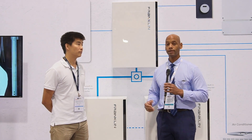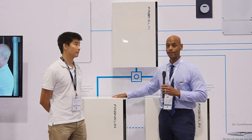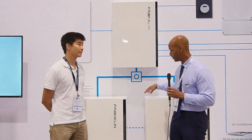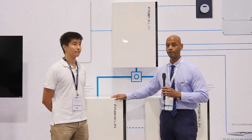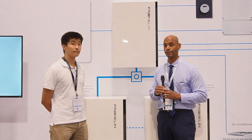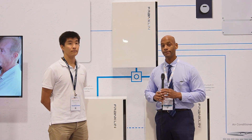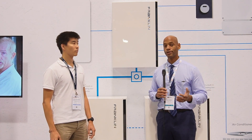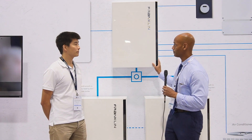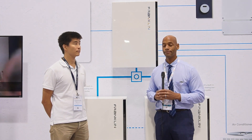This has been a brief introduction of the Franklin whole-home battery backup system. You can technically do a whole-home backup with just a single Franklin battery, though for most clients I'd recommend two A-Power batteries connected in parallel, or you can expand to three or four from there. At least two if you want comfortable whole-home backup and the ability to run central air conditioning during the evening hours. For installers currently offering Solar Plus Storage, or interested in adding storage due to growing homeowner inquiries, this is a great way to get started while minimizing the risk of having to disrupt or modify in-the-house wiring.